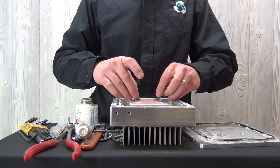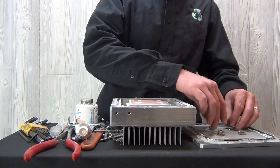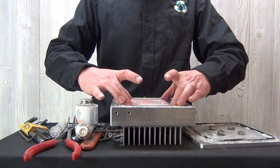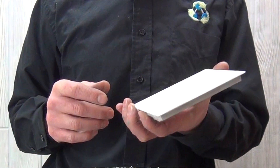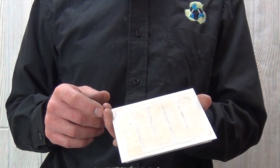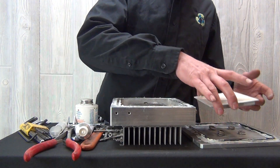There's going to be four springs inside. Pull those off and set them on the plate. Then you're going to have the pressure plate on top — the pressure plate with the dielectric. In this case, our dielectric is not cracked and is in good shape. We'll set that off to the side.